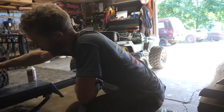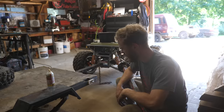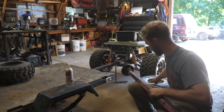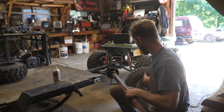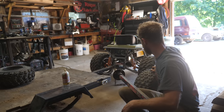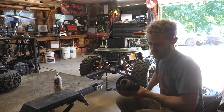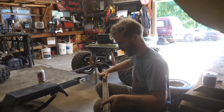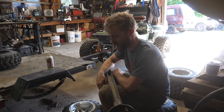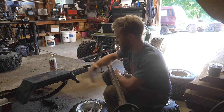We decided to go with the old tires from Sendy because they'll be the easiest to fit and they'll make it ride the most level, and we have them. We thought about using these giant beadlocks from the Sprint car, but they're so wide, they'd stick out super far and make it wider than necessary, which would suck on narrow trails. So those, as cool as they would be, are out. The easiest thing to do here is to just take the whole axle out, cut it in the middle, and lengthen it an inch or two to clear all of the stuff there with the tires. And since these tires are so narrow, they'll still be within the fender and not stick out too far.